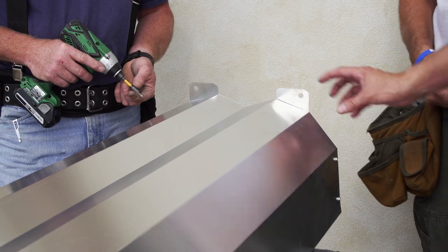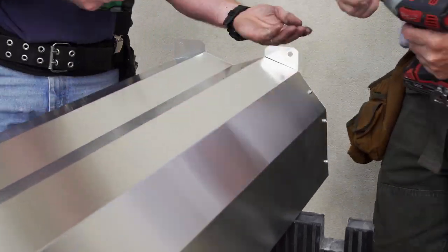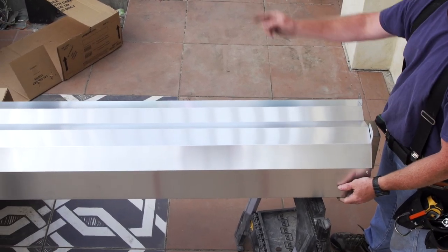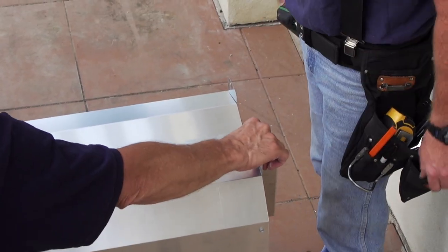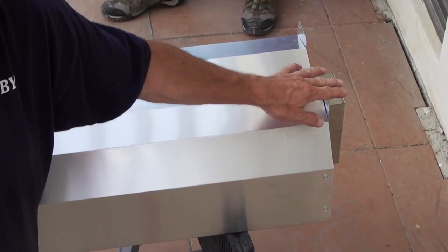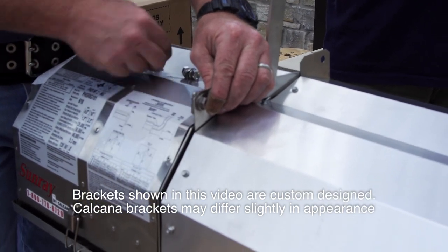After the unit is turned over, you'll notice we have some screws to put in here that were not accessible when the unit was upside down. So we're going to go ahead and put those in, matching the pattern that's on the main base unit. Now that we have a complete unit, looking at it from the top side, you notice that we have three hanging points — unlike the 10-foot unit or the PHS-40. The PHS-50, with the extra piece of reflector and the extra end panel, has an extra set of rabbit ear hanging points. So we have the hanging points next to the burner, 10 feet away another set of hanging points, and now an additional set of hanging points five feet away. All we have to do is attach our brackets in the same way as the PHS-40 10-foot units, remembering that on this unit we have three brackets instead of two for the extra five feet of length.